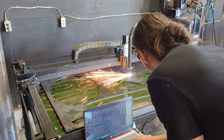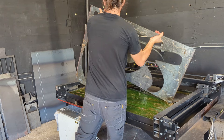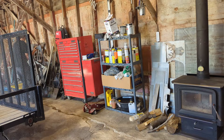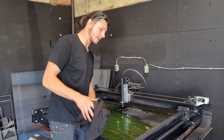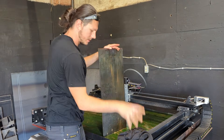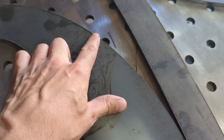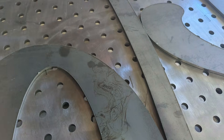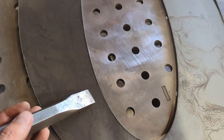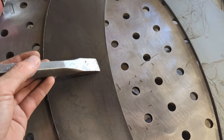The most annoying part of this job is having to manually go and cut out the drop pieces. I think something that would make this much easier is if I had a second plasma cutter as a handheld torch — that way I could literally just grab it after it's done cutting and slice things up. Not the end of the world, but it's certainly annoying. For some reason the thicker material cuts way, way nicer — that's probably because it's traveling slower. Barely any slag, I might not even take a wire wheel to it.